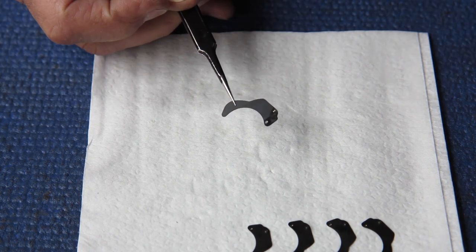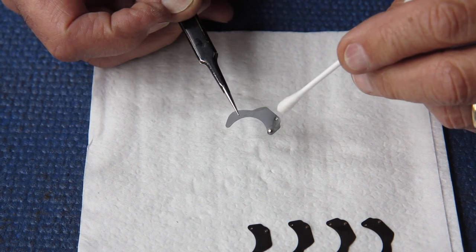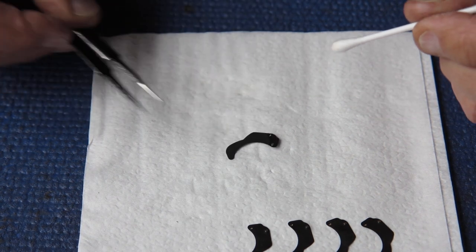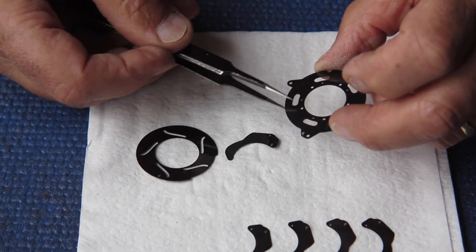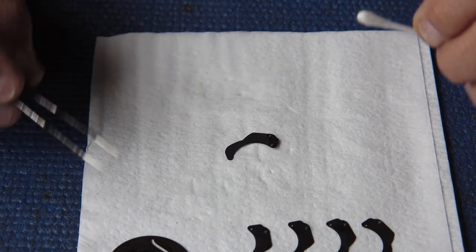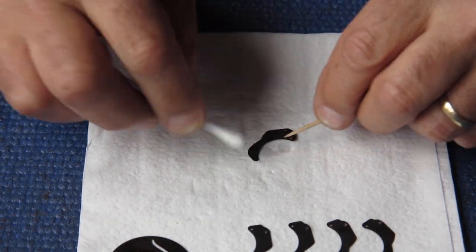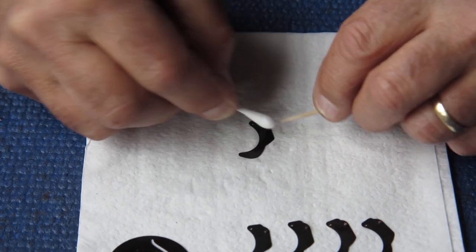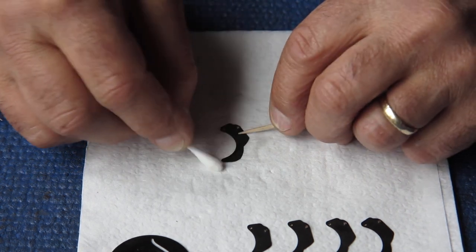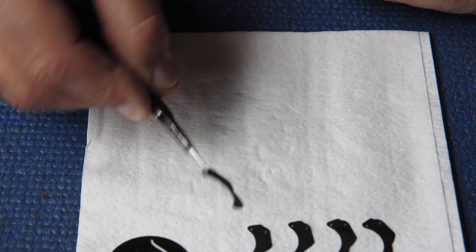Cleaning these blades after removing them - you can probably see the oil staining at this end of the blade. Of course that was underneath the plate and we couldn't see that to clean it. Similarly on the other side. Likewise, these two plates - the moving plate and the retainer plate - were both quite marked and retaining a haze of oil on the inside. So they certainly didn't clean up well using the cotton bud method. Working from the front of the shutter, you would be hard pressed to get the diaphragm free from oil. And in this case I was working from both sides - if you're only poking at it from the front, your chances of getting it all clean are somewhat reduced again.